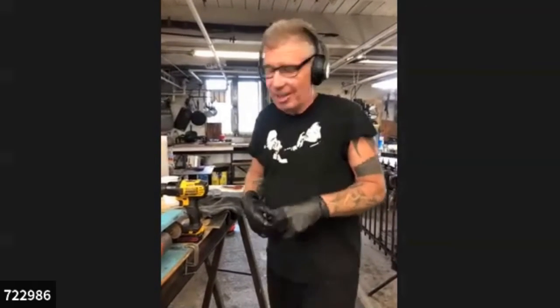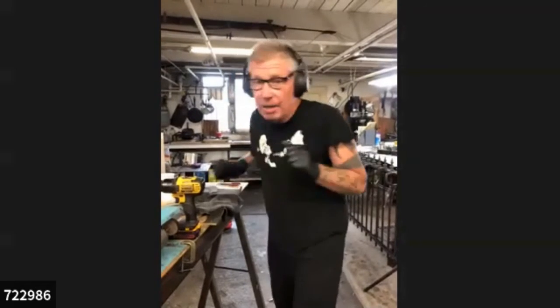So when you tap down, the copper could literally go into the crack and hold you up from having a smooth stroke. But I think it's more like the look of the metal, like on any planishing tool, when you're using regular blacksmithing techniques or jewelry. Planishing tools need to be as fine as possible so that they don't give their own flavor to the design. Does that answer your question?